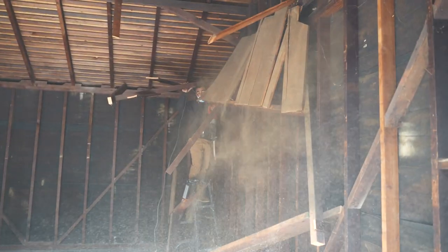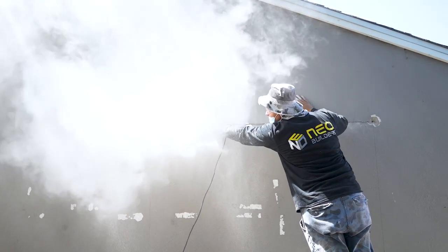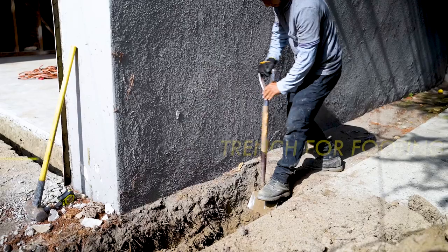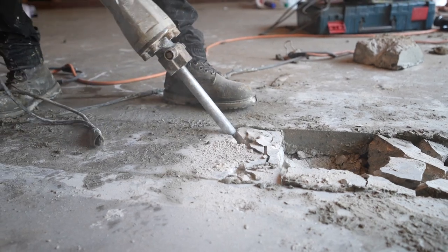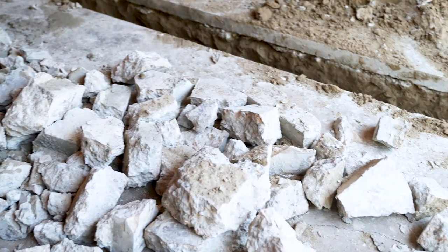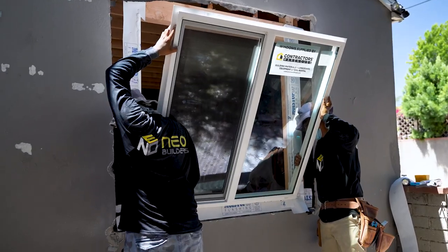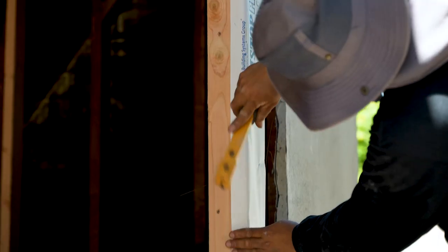We already had a discussion with our homeowner that we are not going to do a re-wrap of the stucco. We want to keep the integrity of the stucco as much as possible, which means today we're going to create the trench for the footer. We'll show you how big a footer we need in a future foundation video, but we still have to trench. We also have windows and doors that we need to punch holes and create openings in the stucco.